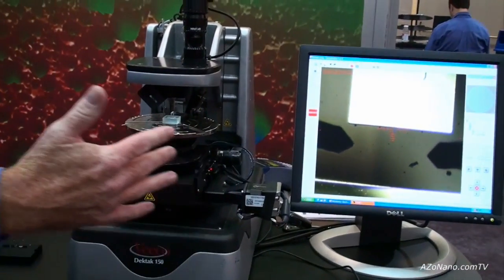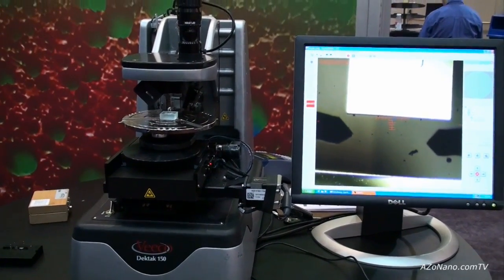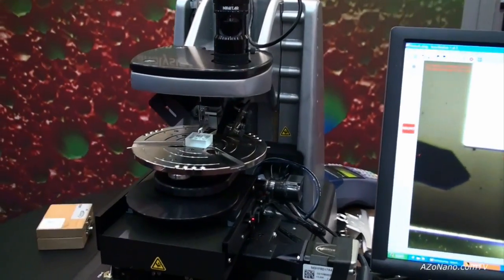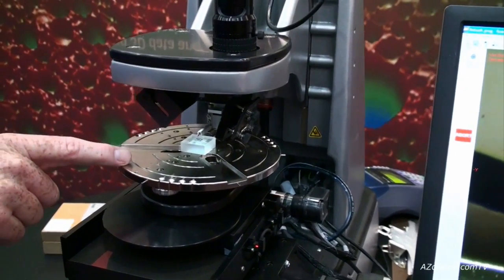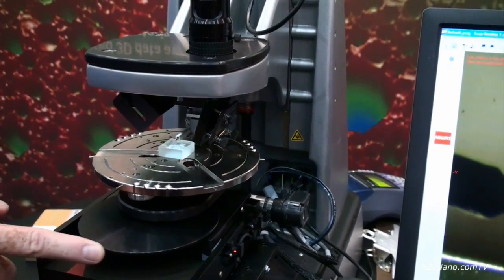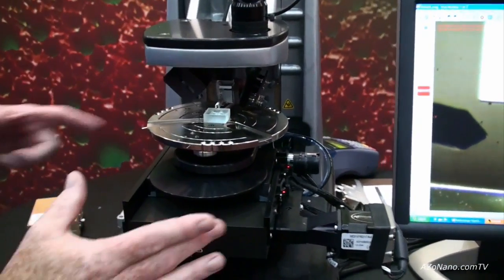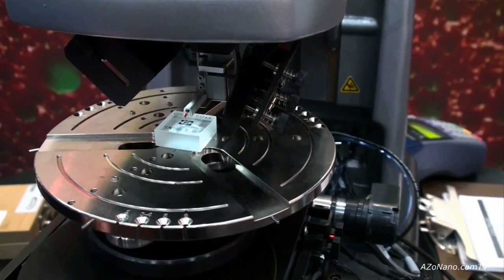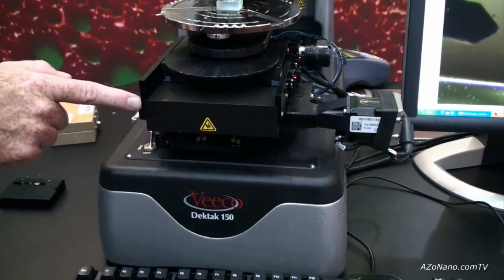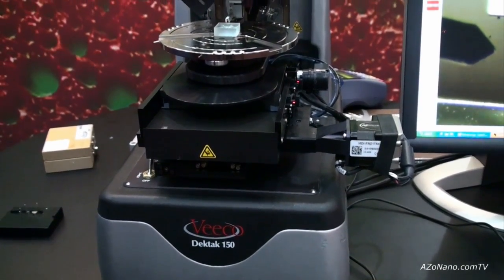This tool normally has an environmental enclosure around it, because the tool is so sensitive — our contact force is as low as three one-hundredths of a milligram — it does not take much airflow to cause the stylus to bounce around. We have a 150mm wafer size sample stage here, which is vacuum capable so you can hold the wafer down. It can also be rotated, and we can adjust the tilt with the knob on the front. The stylus remains stationary and we move the sample underneath it. The key to the system is this reference flat — optically flat to one-twentieth of a wavelength over the entire six-inch surface — which gives us our low noise baseline and our ability to resolve very small features.